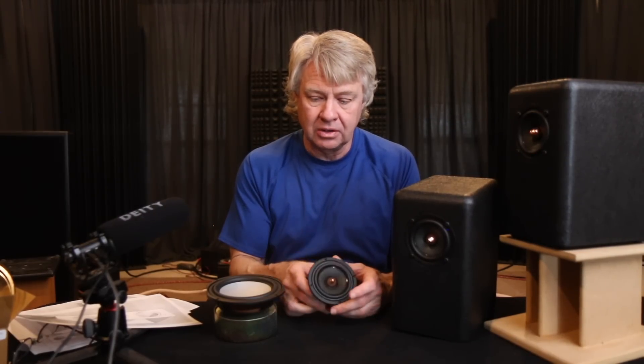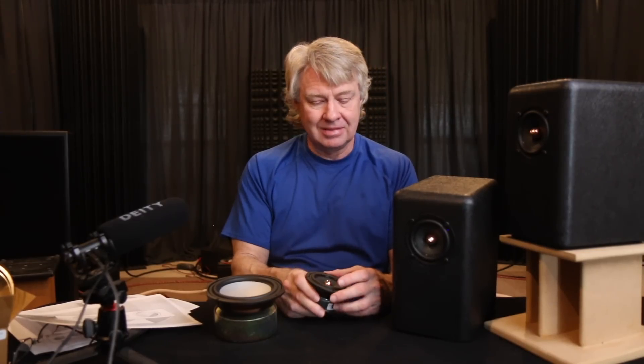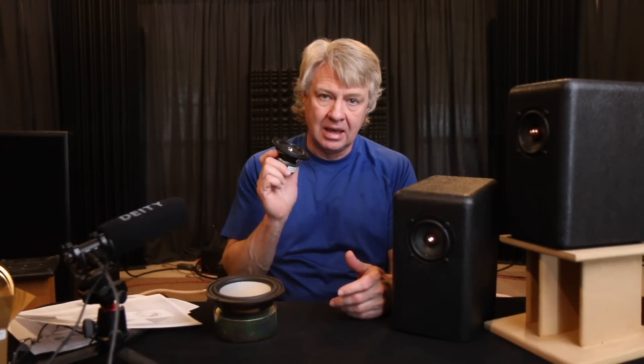If you start getting bigger than a three-inch — going into four and five inch wideband drivers — there are even companies making eight, ten, twelve, even fifteen-inch drivers that are considered wideband and play full range. As soon as you move left or right just a little, the whole top end is gone. You have to keep those things aimed right at your head for them to work. You wind up in a situation where the room response is really uneven with a hotspot aimed right at your head where you can hear the whole frequency range. The overall in-room response becomes very imbalanced. The three-inch driver seems to be the sweet spot — you start getting any bigger and it starts to go south.